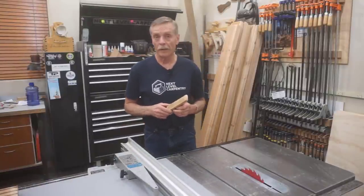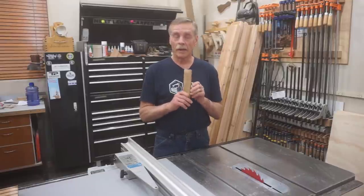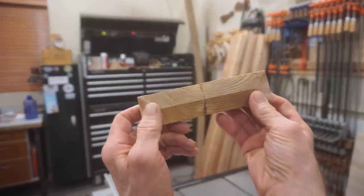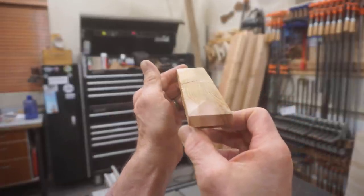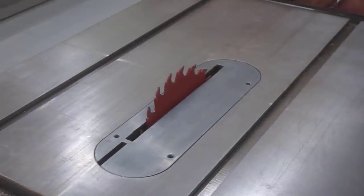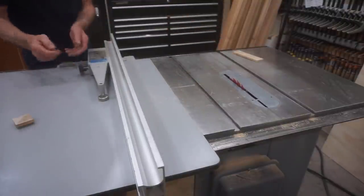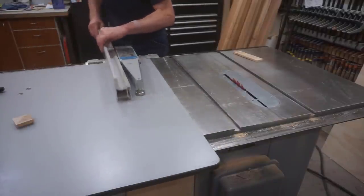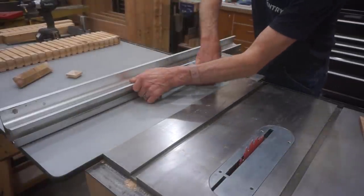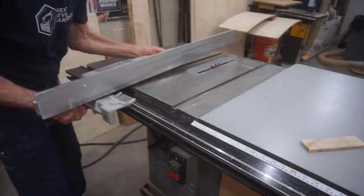Now it's time for the third half of the magic — setting the blade's angle for the bevel cuts on the top. For these plugs I chose 15 degrees. There's nothing really magic about that angle because it's entirely a matter of aesthetics — I felt 15 degrees was a happy medium so the bevel shows up but it's not so much that it looks gaudy or cheesy. To set up for the bevel cuts I tilt the blade to 15 degrees and set the blade height to half the width of the cap. Because my table saw is a 1982 vintage right-tilt Rockwell Delta Unisaw I've got to switch the rip fence to the opposite side, but anyone with a modern left-tilt saw will already be set up for this cut.